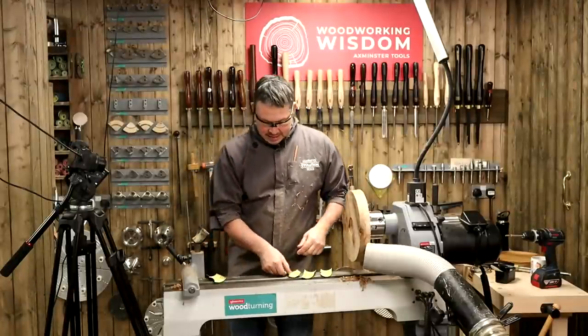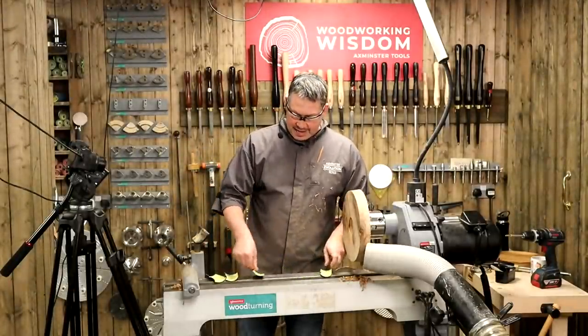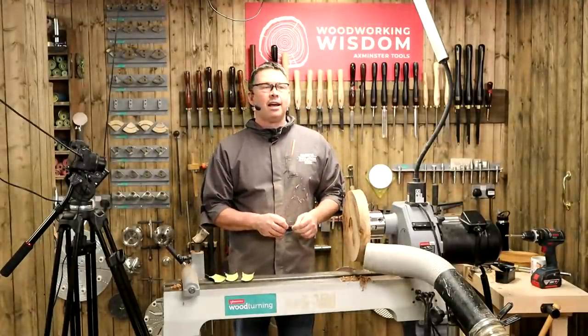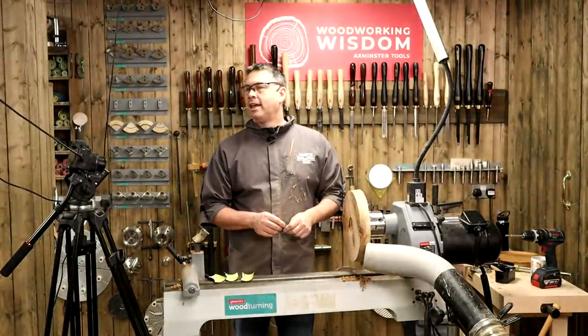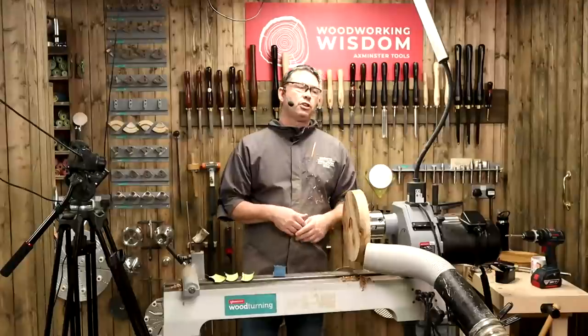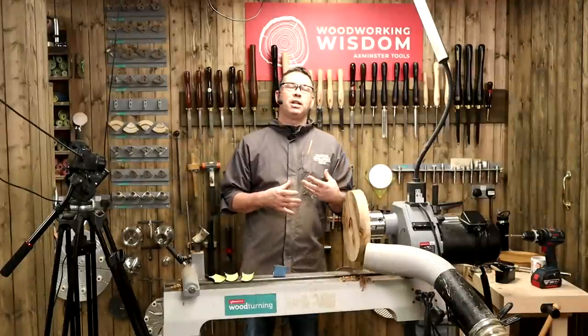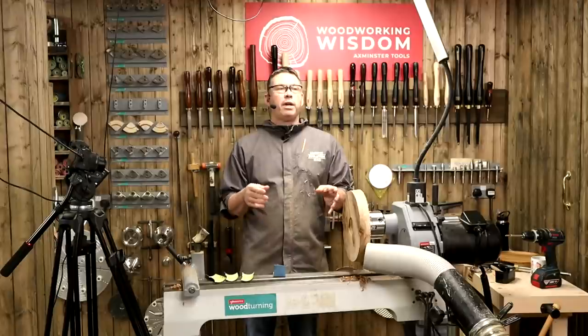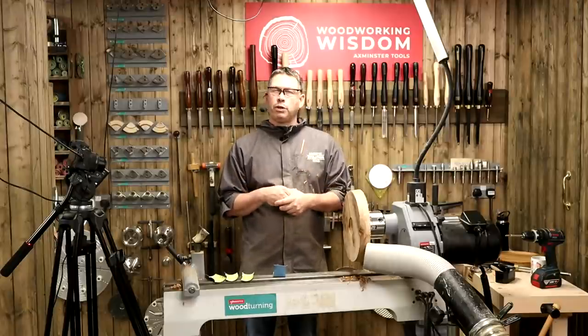Yes, James is saying hi, Colwin. He's just had a go at spirit staining a vase, which was still a bit green. Should he wait until it totally dries out before sealing it, or can he seal it now? Well, what's going to happen, James, is it's going to dry and it's going to potentially crack. So you've got to be really careful with the end grain. They generally move if they're quite solid still.